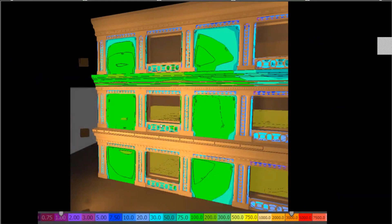Just six Exterior Wash fixtures are creating a nice uniform illumination on the wall, with a lux level close to 100, which is very good for facade lighting. In architectural lighting there are no set rules defining what the lux level should be for a facade, unlike interior lighting where the NBC states different lux levels for different rooms — here we have only guidelines. One major factor defining the required lux level is ambient lighting conditions. If a building is surrounded by a lot of street lighting and light from other buildings, you need a much higher lux level for the building to stand out.